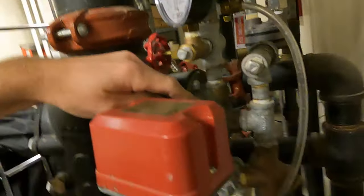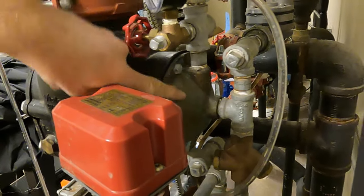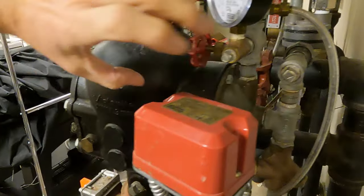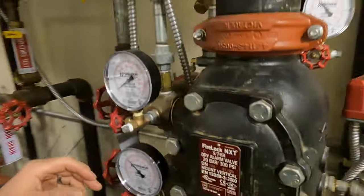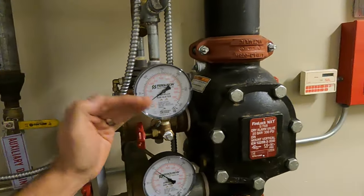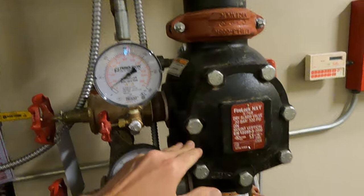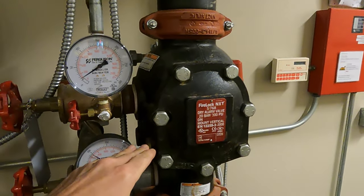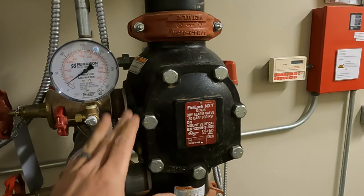This is a little different setup than their previous discontinued 756, but it's all built inside here instead of a screw-in piston. Basically it's the same idea — there's going to be a piston holding the latch shut, keeping the valve closed. But when that's open, this operates just like an alarm valve would.